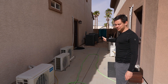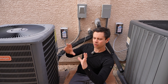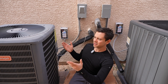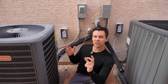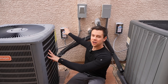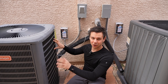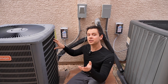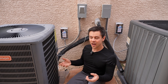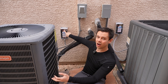We actually installed soft starts on those traditional air conditioners and they were very easy to install. It's confusing at first when you read the instructions without an air conditioner in front of you, but I promise it's very simple. Before I installed it, it took 100 amps to start up the compressor in the condenser unit — that is a massive amount of current, especially for an off-grid solar power system. So if you're trying to run your entire house off of an off-grid inverter and the limiting factor is the air conditioner, you should consider a soft starter.